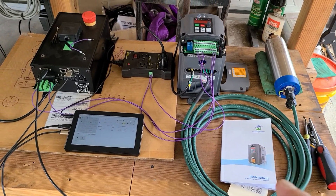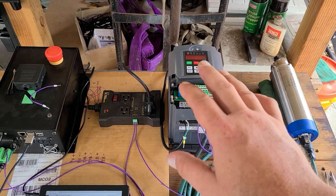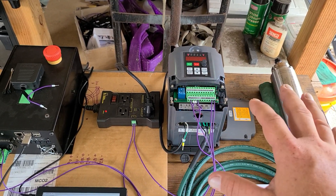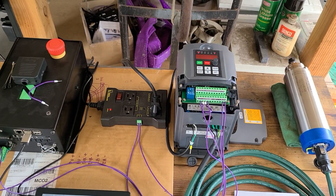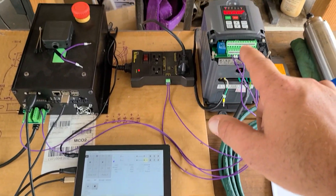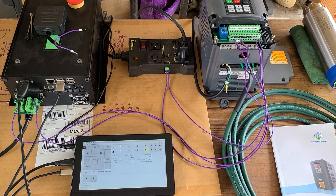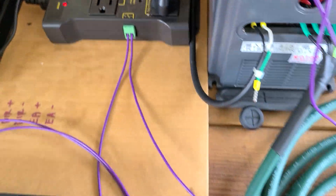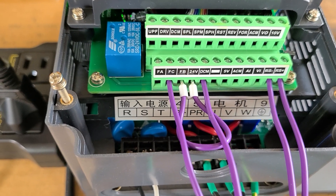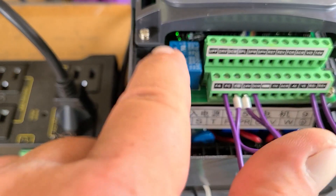Obviously, this is for spindle users. Let me first start off by saying that all the motor parameters and everything have been set up that need to be set up, aside from the RS-485 communication for this to talk to this. All of that is in here on how to set up the drive for communication — it tells you the parameters to change. What I'm using to trigger that IOT relay is this wire here, essentially a ground or digital common. And then you will see that 24 volts is run through to the FB input terminal of this relay.